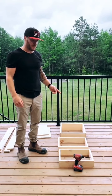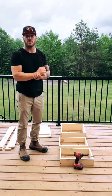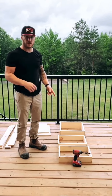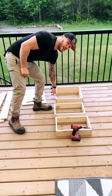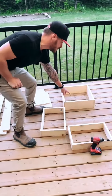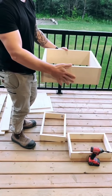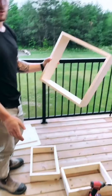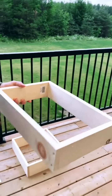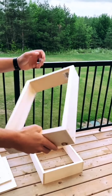Once I got my material cut — I used a chop saw, but you can use a skill saw, or honestly the easiest way is to go to a big store like Lowe's, Home Depot, or Rona with your measuring list and they'll cut them for you. So first, the boxes: the first bottom base is also your bottom stair — all 18 inches long. This box is 18 inches one way and 16.5 inches the other, so you put your 16.5 on the inside and screw your two 18s on the outside, making a perfect 18x18 square. The second box is the same idea: two 18-inch pieces on the outside and two 10.5-inch pieces on the inside, making an 18x12. I used regular wood screws — you can use cabinet screws and it wouldn't hurt to pre-drill.